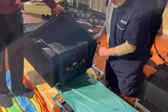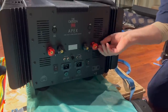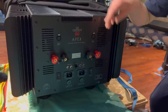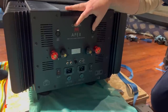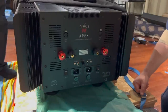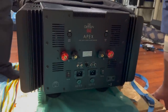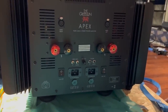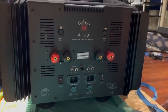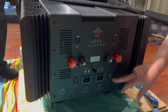Let's take the cover off for the unveiling. Looking at the back: we have some pretty nice five-way binding posts, so bananas and spades — I don't think anyone's doing bare wire at this price point. Notice it's only balanced inputs — a truly balanced design end to end. We have fuses for each of the 20-amp inputs, the green bias control — more on that in our Commander video — which keeps the amplifier always in Class A but at the lowest power output necessary to keep your room cool and not suck up as much power. There are triggers, a ground, and each side does have its own power switch.